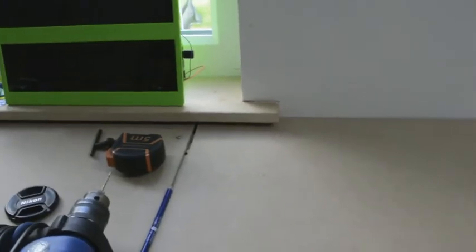So it's now time to fix the boards to their posts, and over here you can see I've already marked out where to drill. So I'm going to fix this into this post which you've been watching me construct, and then do the other side afterwards. And then when that's all done, I shall be putting in 2x1 frames underneath, or matching up and cutting into size, so that it can all be fitted on whilst the board is in situ.